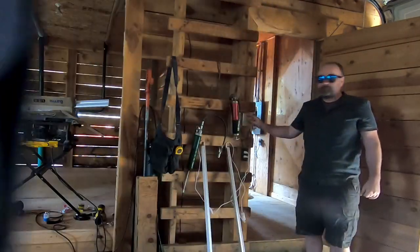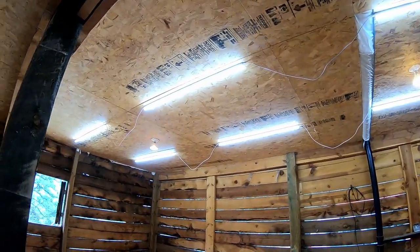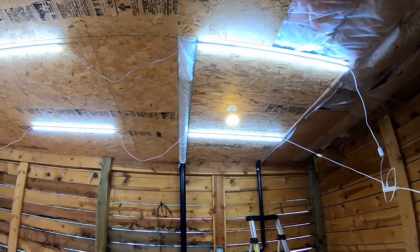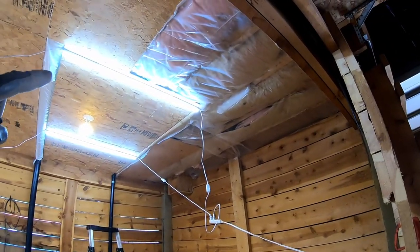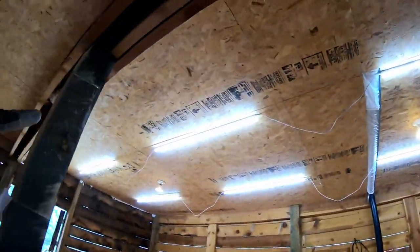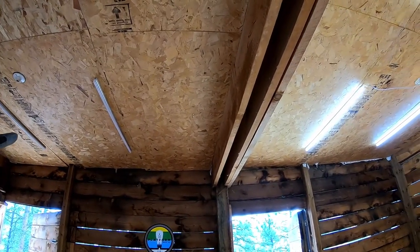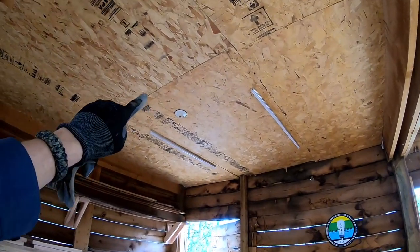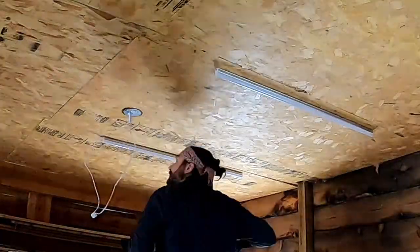With eight of those on you're gonna have quite a bit of light — look at this! We got some lights up in here. My buddy that I'm building this for installed these LED lights, and there are two more over there. They're all daisy-chained, so we're going to connect this leg to this — we'll have to make a custom wire for that — and then this end is going to come through this beam into there. That lamp socket is going to get replaced with an outlet so we can put the lights on the existing switch, and that'll turn on all these LED lights.